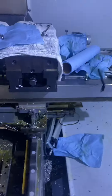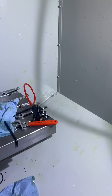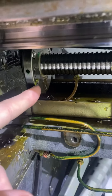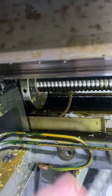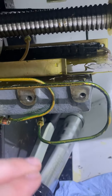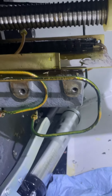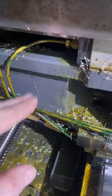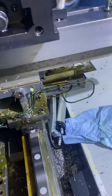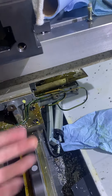I'll give you a quick look inside the machine. This is a coverall kind of job. I've literally been crammed into the corner back there, and my right leg is now completely numb. But what I was just showing you is your restrictor off of the x-axis ball screw. The manifold is down there. Why they put it right there, I have absolutely no idea. They could have done a second manifold right here, or one big manifold block, or any number of things differently.